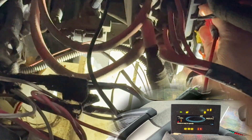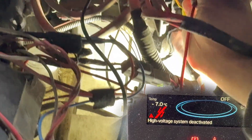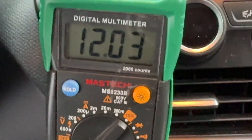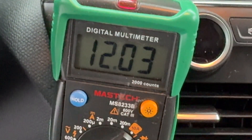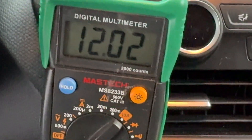Pull the negative battery terminal off, take that off, and check the battery - that's it. I've got 12 volts there now doing the same test but with the electrical machine electronics disconnected, so no alternator charging. It's not bad, but that doesn't tell you the full story. A good battery is usually about 12.5 to 12.6 volts, so I'd guess this battery is old and done.